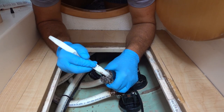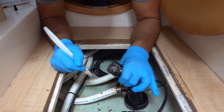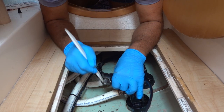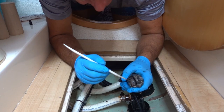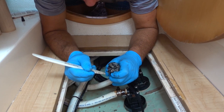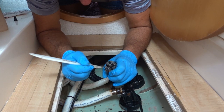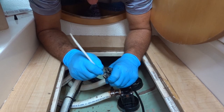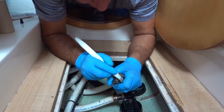Is this protected under the water by anything surrounding it? Nope. So it's kind of exposed, and if that thing ever got damaged we'd have a bunch of water in here. Mark's boat was flooding because it got damaged when he got hauled out. So why is this important? Well, it does a couple of things: it measures your speed through the water as opposed to your speed over ground, which gives you an indication of current. It also measures your distance traveled. Our engine hour meters don't work, so we can tell by how far we've gone and at what average speed how many hours we've put on the engines for service. There are lots of things on a boat where you time the service intervals based on how far you've gone.